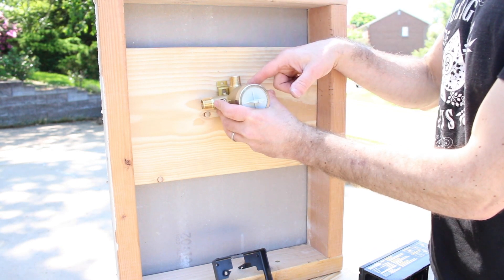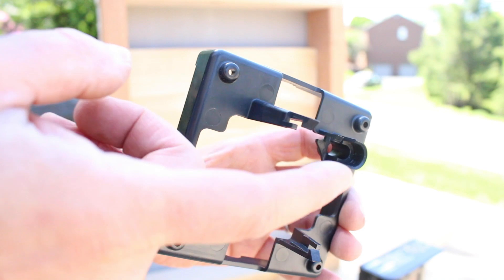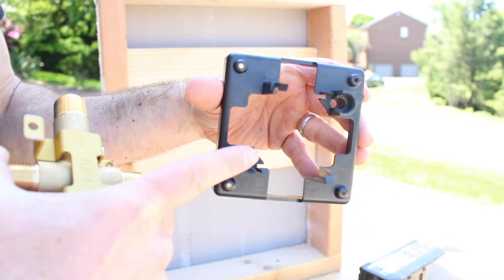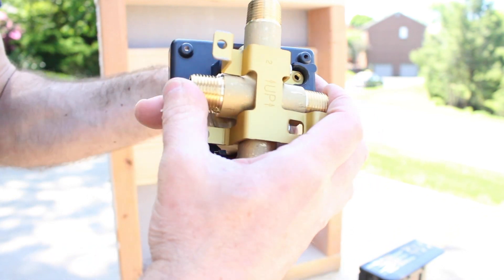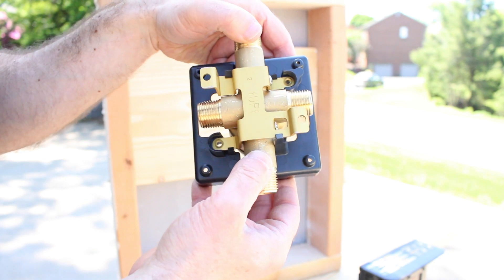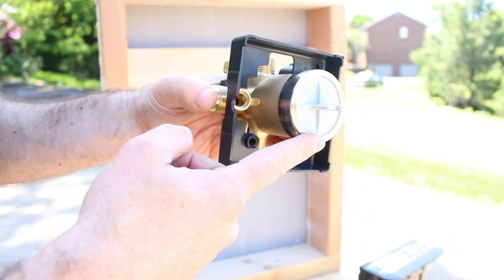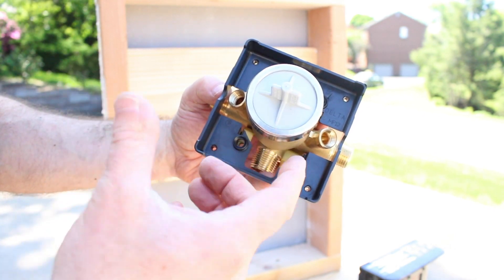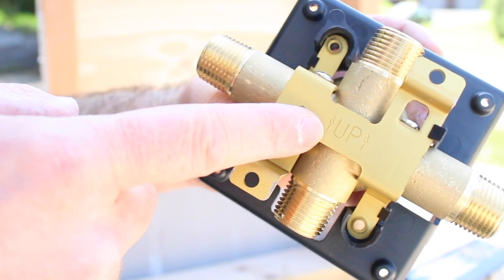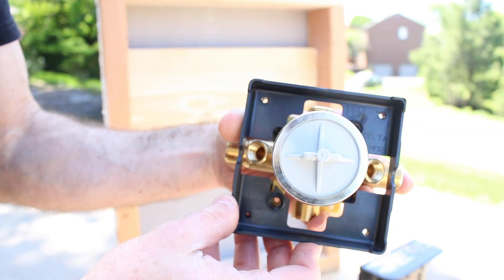We have our blocking inside the wall here, and you simply mount the multi-choice to it. This comes with a plaster guard. As you can see, there are little hooks that go onto the back of the rough-in valve — there's a footprint on the back that makes it pretty straightforward. You just fit the multi-choice into the footprint and push it until you hear a click, and these hooks notch in and hold it in place. It's really important that the plaster guard is on there. There's an 'up' insignia on the plaster guard, and on the back of the multi-choice it says 'up' with two arrows, so it needs to be pointing upward when installed inside the wall.